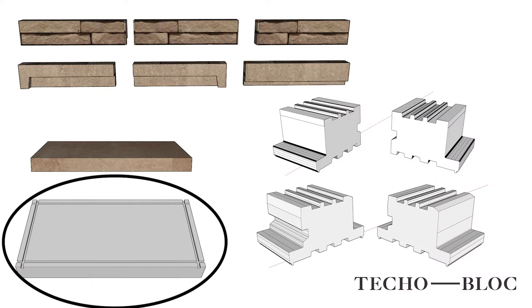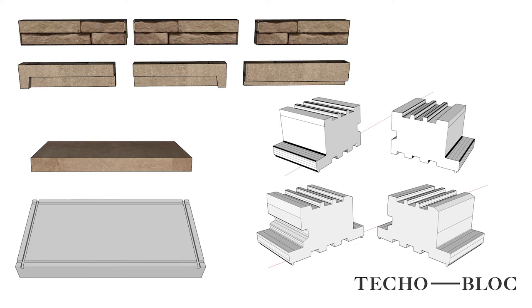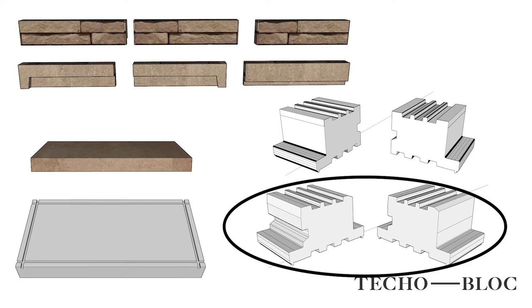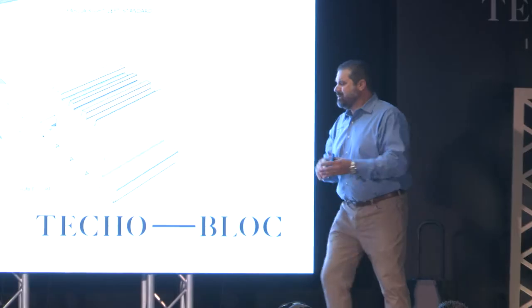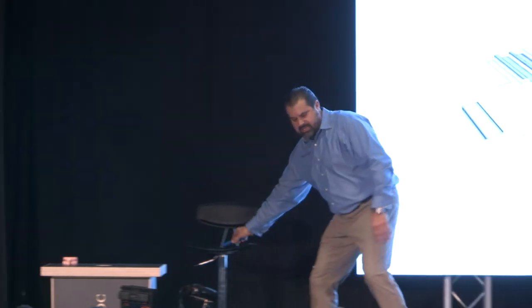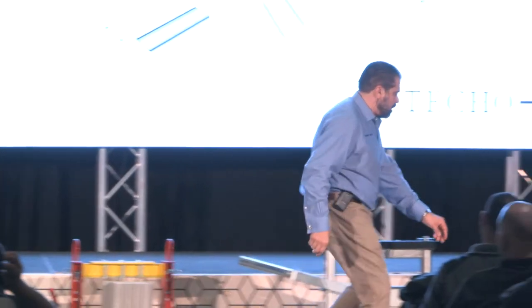Here's the layout. You've got the base core units which have the grooves already manufactured in them — single sided core — so you can build structural walls, vertical or setback, 20-30 foot tall. You have a double sided version, and then you've got the fascia system. Let's just show them — let's build it live here on stage so you guys have an opportunity to see how this wall works.